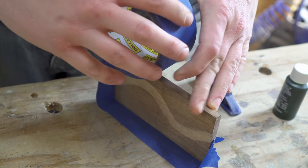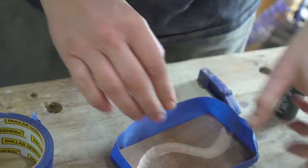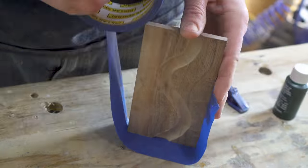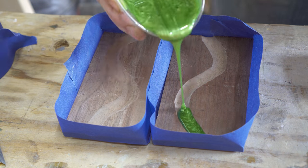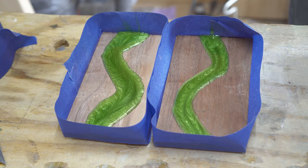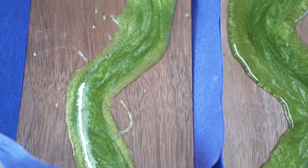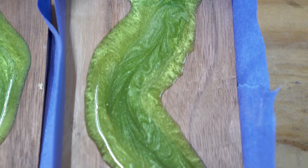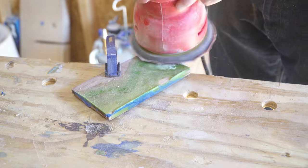For this project there was no need to make a big crazy mold — just some tall masking tape to mask off the ends and around the sides to stop the epoxy from leaking out. I mixed up some beautiful custom green, then went back and added a bunch of light-colored pearls to the same mix and added that through the center to give it a really pretty pearl wispy pattern through the sides of the river pour.